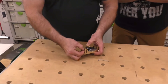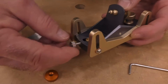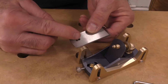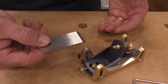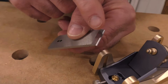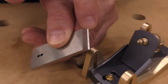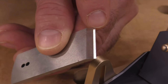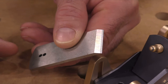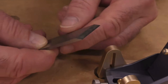Here's the blade. It's got two notches on it and goes right here. This is a Norris style adjuster. This is bevel up, which all block planes are. I want you to notice this — it came honed or sharpened with a micro bevel. Your typical 25 degree is right here, but then Bridge City Toolworks put a micro bevel on it. So what's the thing I've always taught you about any blade out of a brand new plane? It needs to be honed. So just a quick honing now.